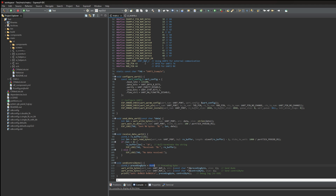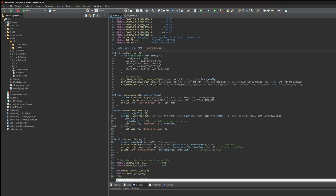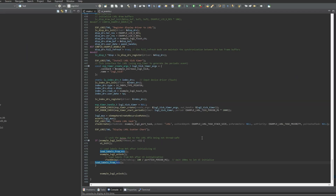We need our UART configuration coded in with our definitions: UART number two, TX on pin 43, RX on pin 44, along with our UART configuration including the baud rate of 115,200. I'm not an expert, but I wanted to show this for people who do know more about it. We have our receive and send data functions as well. Lastly, I wanted to point out the Load Labels from NVS function — this is where the ESP32's NVS flash storage loads the button labels after every restart, saving them when you press Save on screen two.